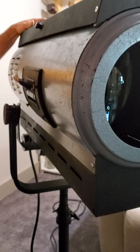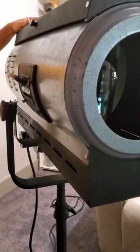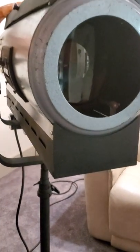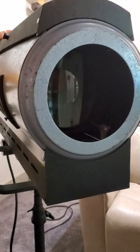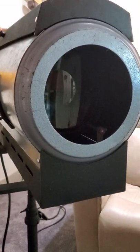On a side note, everything will come with the light. If you want to use it as a 1,000 watt spotlight, you still have the original bulb — it works. Nothing internally has been changed. You just unbolt the candelabra base, bolt the 1,000 watt fixture in place, and you're up and running as a spotlight.